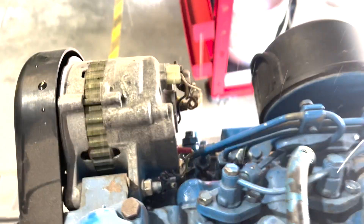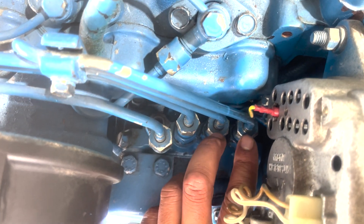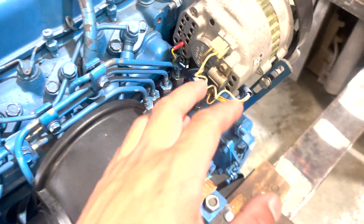The fuel pump is on and you can see it squirting out there. There's definitely fuel going in here — I can feel it. Remember there was fuel coming out of these ones even with the pump on, but this one is just sitting. There's no fuel coming out of this one even when I crank it. I think there must be something wrong with the fuel pump. It seems like there's something wrong around the injector pump, so I'm going to remove the injector pump for the first time.